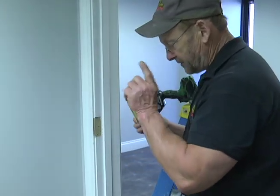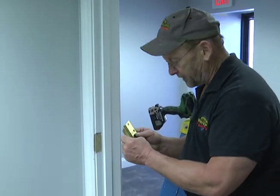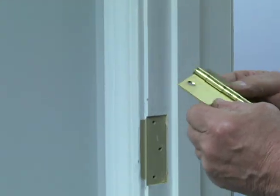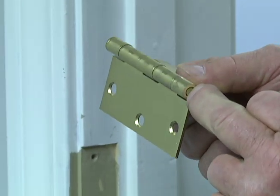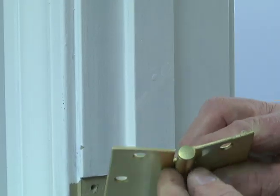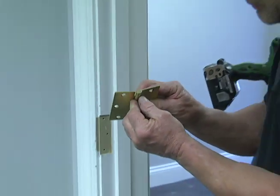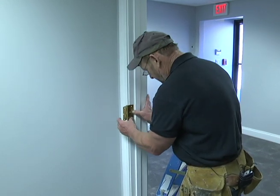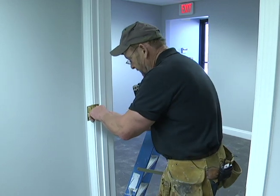When you put these hinges in, always remember, there's a bottom and a top to these, and the way you tell is that the top has a pin that connects the two pivots, okay? You'll notice the bottom is the pin that you drive up. You can drive that up with a nail set, but the round part, the smooth part, always goes facing upward. Just remember that and you'll be okay. So now we put the hinge in place, and we can start putting this in permanently.